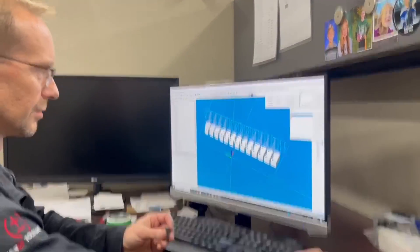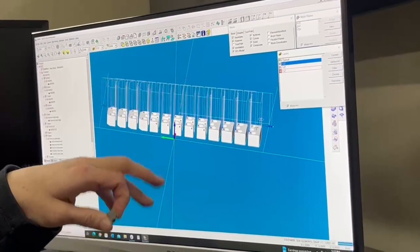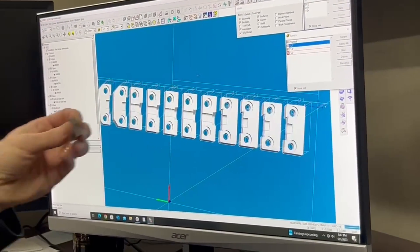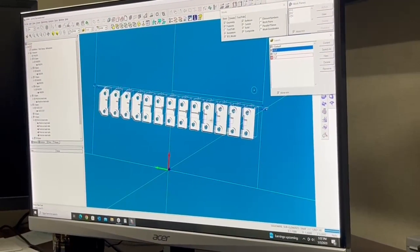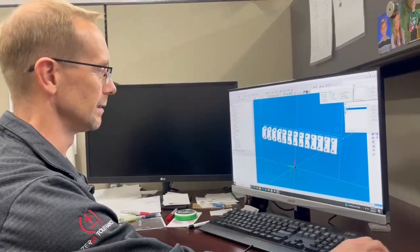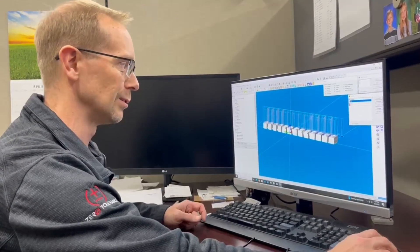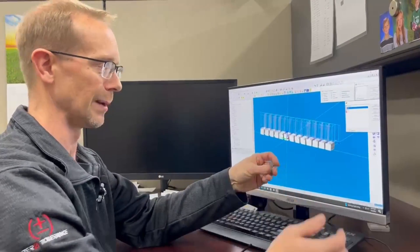A better way of doing these inserts is putting them in a block that's square. We can grind it all together, machine the holes on the CNC, then put them in the wire and wire the whole profile instead of manually squaring them in a mill. We can wire these out and have it unmanned — machines running, not a labor hour. This is actually the next best way we found to do these inserts. But there's still work to do after we wire them off, which means you're doing a lot of manual labor on this as well.